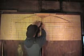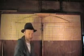So here we'll go ahead and put the string, and then come back and I'll flex the bow. And we'll begin to see how the limbs are bending. This bow is bending more on the left side towards the handle, which I don't like. I like the way the upper limb is bending more. Can you point that out? And I'll hold that. Here you go.